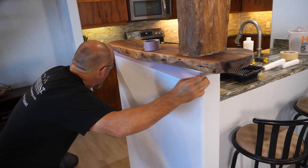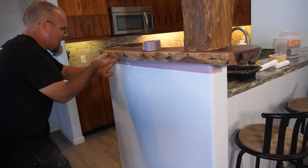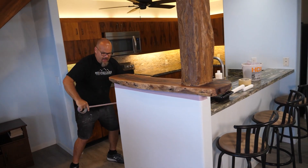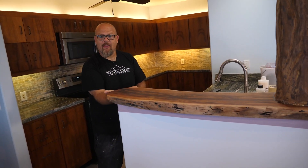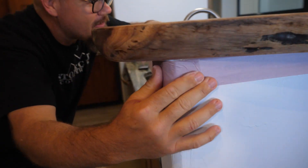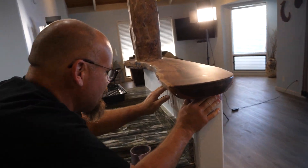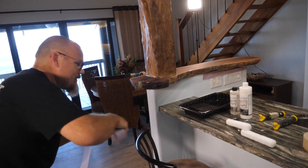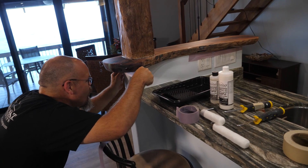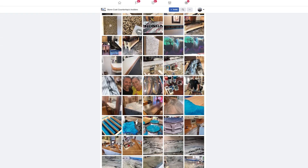I'm using delicate surface tape so none of my fresh paint gets messed up. I'm masking off underneath here because I will roll that Ultimate Top Coat under the edge for extra protection — it will feel the same. People see with their hands as well as their eyes, so when you wrap that piece it takes you to the next level. I'm using the delicate surface tape for the perimeter, then I'll use my handy masker to finish masking off. The nice thing about the Ultimate Top Coat is you have enough working time to wipe up any spills. It's a water-based product so there are no noxious smells, but it's extremely durable.